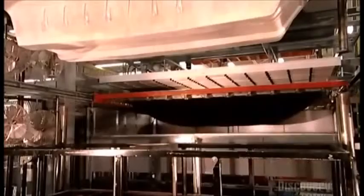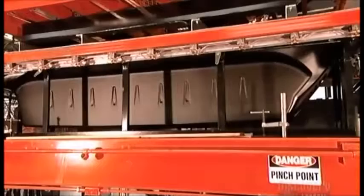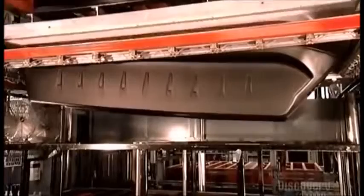To make the vehicle's lower body, they take a sheet of polyethylene, a heavy-duty plastic, and heat it in an oven. After four and a half minutes at 232 degrees Celsius, the sheet emerges softened by the heat. An aluminum mold drops down, and a vacuum-forming machine stretches the plastic around it, sucking out the air from between the two. After the plastic cools for four and a half minutes, the machine lifts the mold, leaving a cavity about the size of a large bathtub.